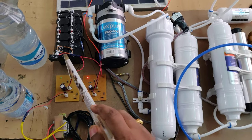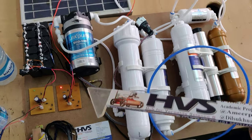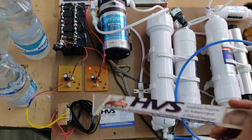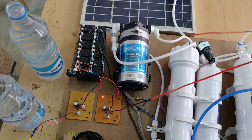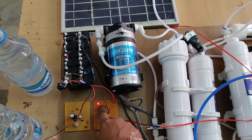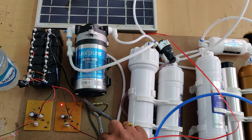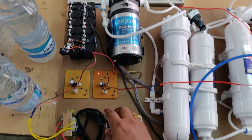When we are using the battery, we have a chance of charging it, so we can use renewable sources like solar. In our project, we are using a solar panel — a 24 volts 10 watts solar panel — which is able to charge this battery. To charge the battery from the solar panel, just connect the solar panel at this slot. Due to the low lighting on the solar panel right now, we are getting low intensity from this LED. This is the charging section for the battery through the solar panel.